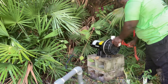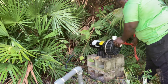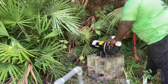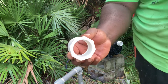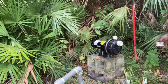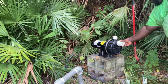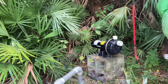Now we want to give it a little hand-tighten — not too tough, because these Everbuilt pumps have a little plastic coating. Hand-tighten them nice and snug; same thing with the top. You don't want to over-torque it. This is a two-by-inch-and-a-half reducer bushing, because the original suction line below is an inch-and-a-half. So we've got to reduce it so all the fittings can fit together. That bushing goes right in there, reduces it, and that way I can add the proper fittings.